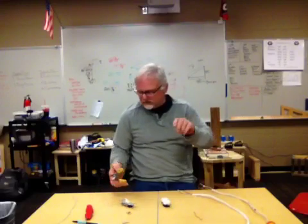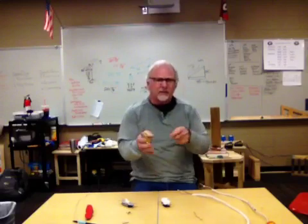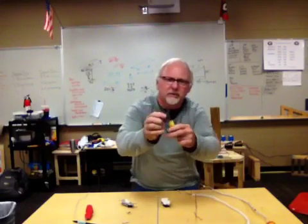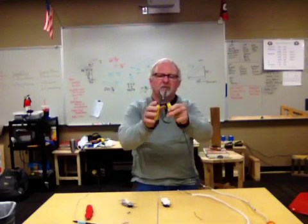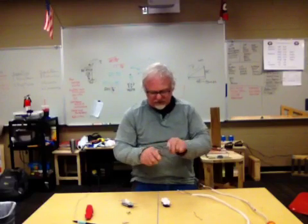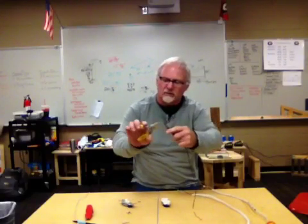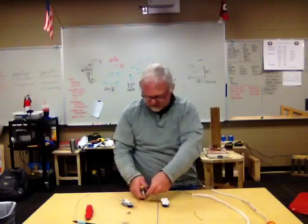First thing I want you to do is take either the black or the white, I don't care, you've got plenty here. And you're going to practice stripping and curling a wire. So on this tool here, you'll notice that there's numbers when you get up close to it. They indicate the size of the wire. I believe I'm getting, I'm going to check right now, a 14 gauge wire. Okay? You see what I just did there? I found the number 14, 12 on one side, 14 on the other, find the 14, and I stripped the wire off.